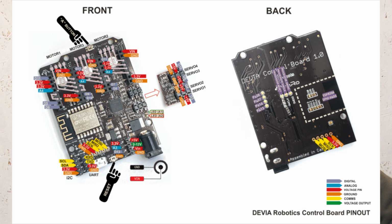And according to the information, and I've actually got the board right here, it has the same footprint as an Arduino UNO. Again, that's used for a lot of electronics projects because they're relatively cheap boards that people can get hold of. So that's pretty cool. In terms of programming the board, it uses the Arduino IDE, and within the IDE, the board that we would select is the Arduino Zero, obviously because it has the same processor. So yeah, that's basically the features of the board.